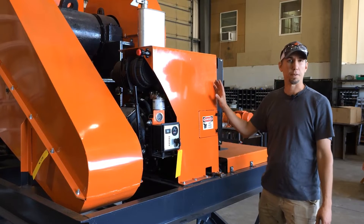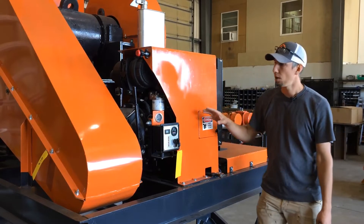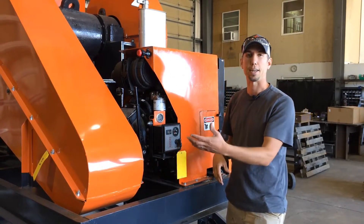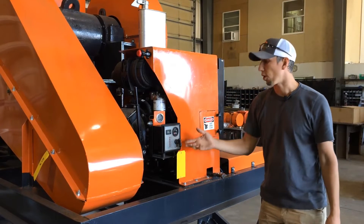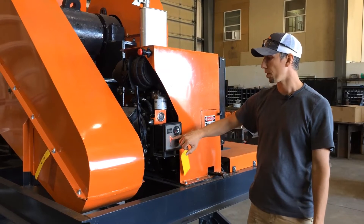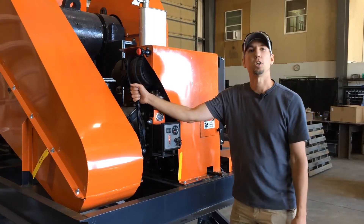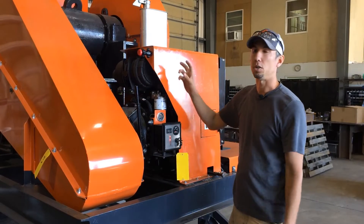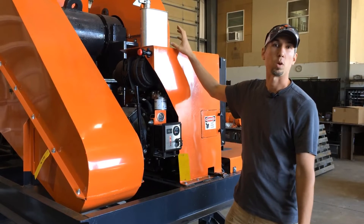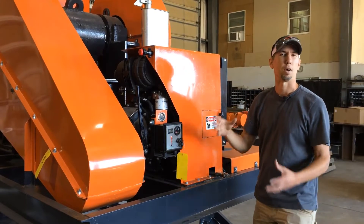So this is again about a 50 horsepower Perkins engine that runs this unit. It's a water-cooled engine, and it's a four-cylinder diesel. We've installed an over-center clutch here, so you can start the diesel, get the RPM where you like it, and then engage the jaw crusher. The starting procedure: you get the key going, you have the glow plugs, I like to start it up and get it about 1200 to 1400 RPM, engage the jaw crusher so it's a little bit easier on the clutch, and then you use the throttle up here to increase the RPM of the diesel until the jaw crusher's running about 275 to 300 RPM. And on the RPM gauge here on the engine, that's about in the 2000 range.